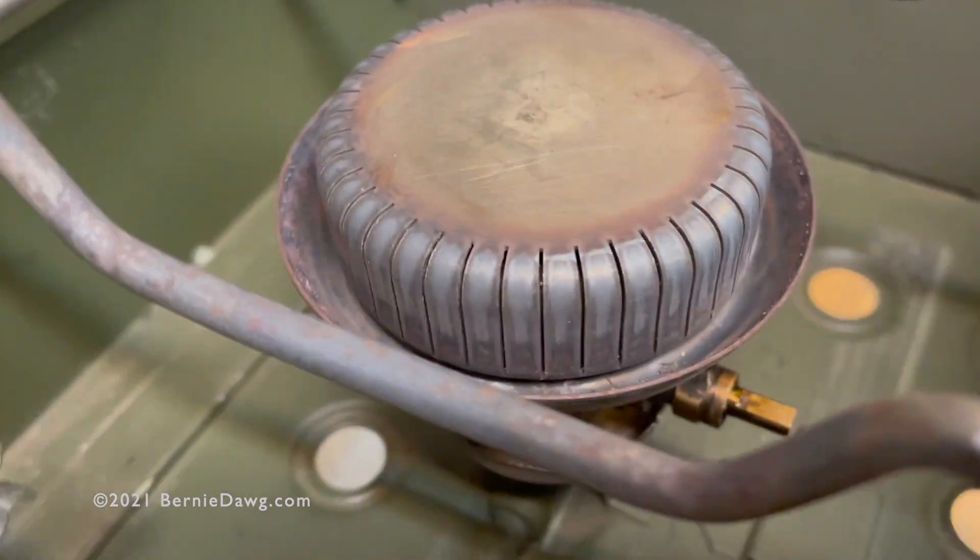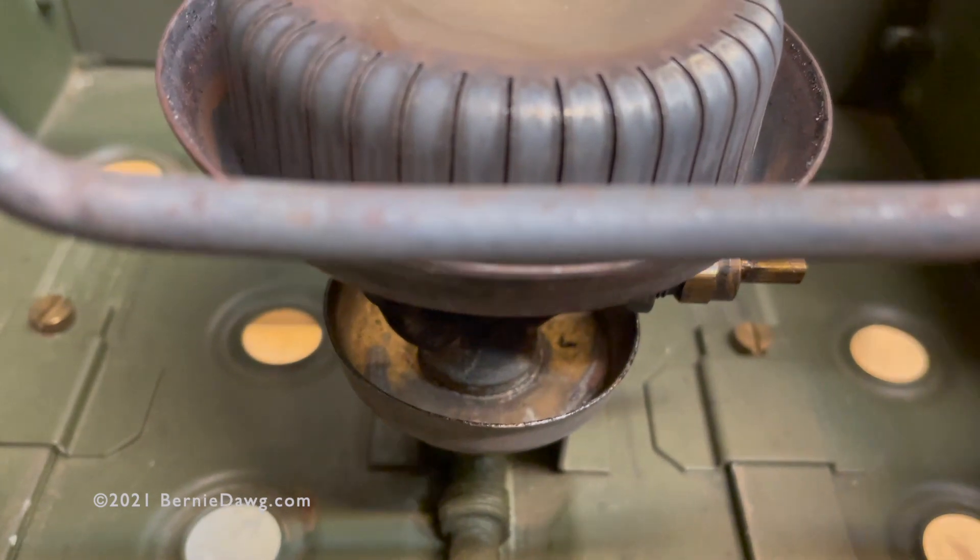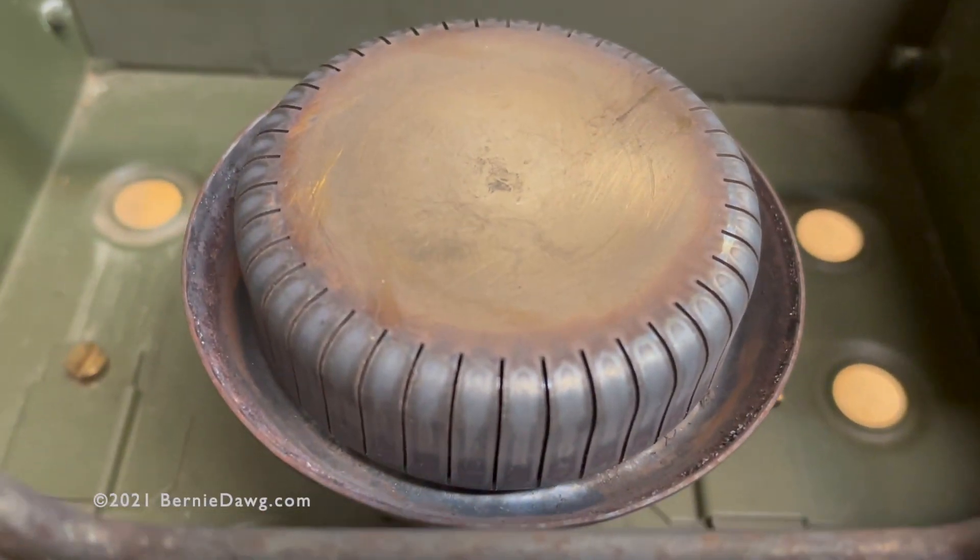The number two modified stove only comes with two tools: the wrench on the flap that you can see, and also the multi-tool, which is kept in some clips. The multi-tool is used to control the spindle of the stove and the power of the stove. This very large burner head has slots instead of holes — the slots make a really unique flame pattern, and I like it a lot.